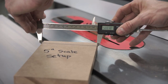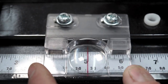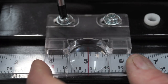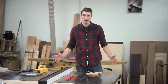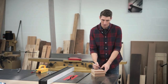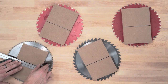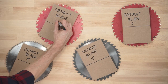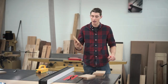Once you make a cut that gives you a caliper reading of exactly 5 inches, you can move the cursor on your fence scale. The caliper says exactly 5 inches, so I need my fence scale to say the same thing. All we do is loosen these bolts, move our cursor to exactly 5 inches, and tighten it down. Your riving knife is calibrated and your fence scale is accurate — it's time to set up our arbor shims. You need one five and a half by eight inch board for each blade you intend to set up. Draw a line down the middle of each one of these boards, and on the top half of each board write '5 inch default blade.'